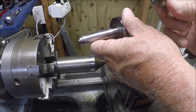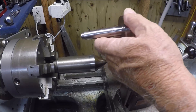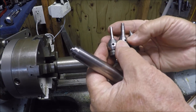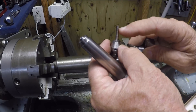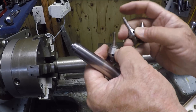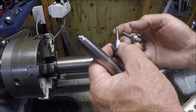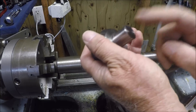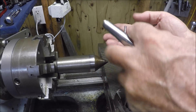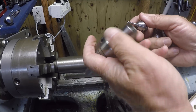So it's a choice of either cutting a 60-degree center in here and being done, or making a new piece. I think I'm going to go ahead and see if I can just cut this. The unit also came with various other tips - a 60-degree center and replaceable ones for different setups. This one was stepped for going into a bore, this one has a thread someone did in the past. I'm deciding whether to make a tip insert or just machine the existing piece.